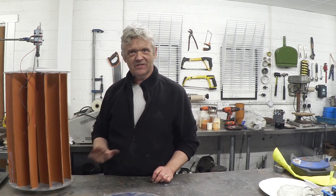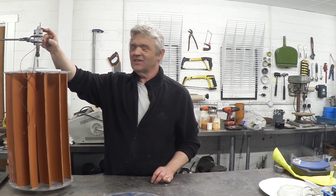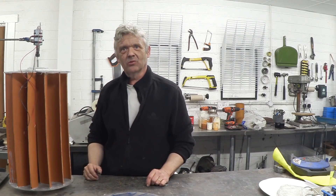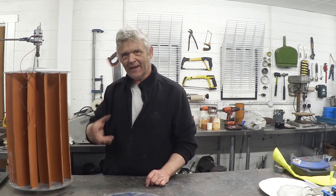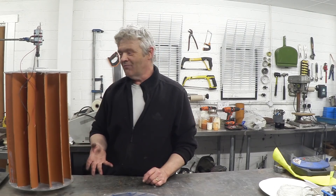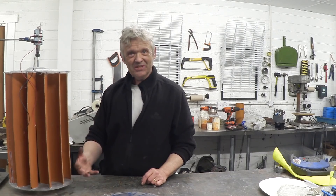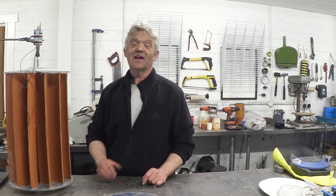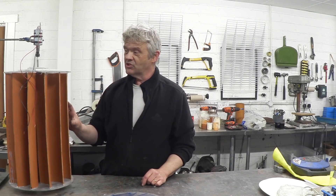I need to get it into some kind of breeze and take some readings, but this is really quite exciting. I'm going to change out this little motor and put a bigger, chunkier one in to make this an actual generator rather than an experimental one. I'll probably play around with the fins a bit — their angle, attack, spacing, and all that. I know that bent pipe is nowhere near as good as a proper aerofoil, of course, but it's really easy to make and that's the whole point. In the little breeze we did have, it qualitatively performed a lot better in this structure, which also makes it much stronger.